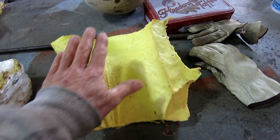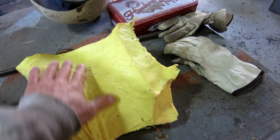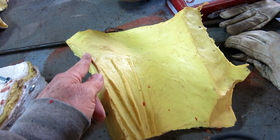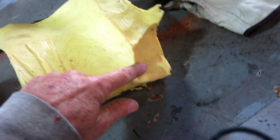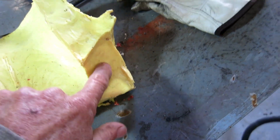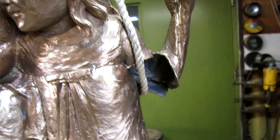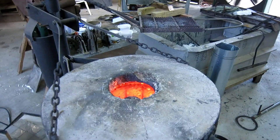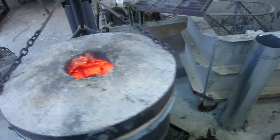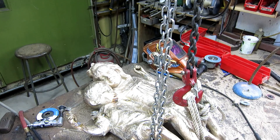A week or two ago when I did the wax of this mold, I painted it all and then trimmed it nice and neatly around the perimeter. But I made a mistake — because this is not the perimeter, this is the perimeter — so I cut off this piece which I didn't mean to do. That is why we have this big hole in the arm, because I never cast that piece. Right now I made a separate mold, I'm heating up my little crucible, and I have a small pour with just that piece.